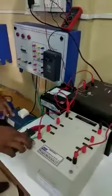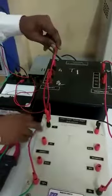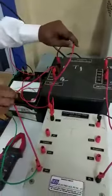This is the neutral black color wire, connected to the V terminal of the wattmeter. This green color wire is connected to the P2 primary terminal of transformer T2. Then P1 and P1 are short circuited, and P2 and P2 are short circuited.